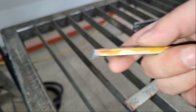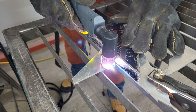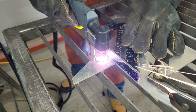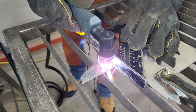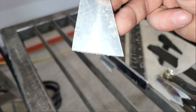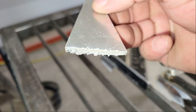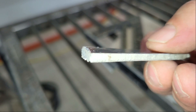What I was really curious about is whether or not it can cut something soft like aluminum. All I had was this 3mm thick sheet, so I set the current to the lowest level at 15 amps at 30 psi and tried that. It didn't quite make it through on that pass, so I increased the current to 20 amps and the air pressure to 35 psi and tried again. This time it cut through, and the edge isn't the cleanest, but it's reasonably straight — good enough for rough cutting parts at least.